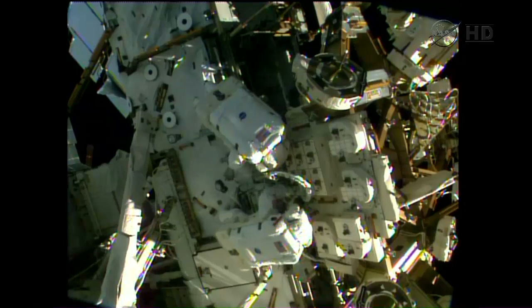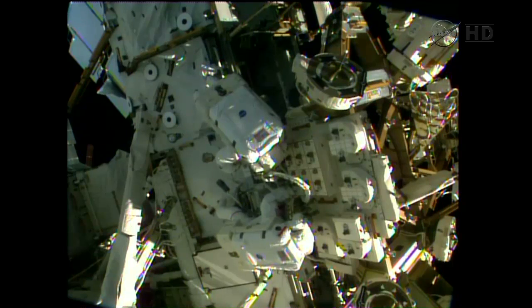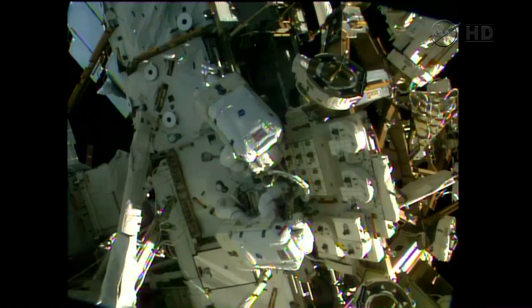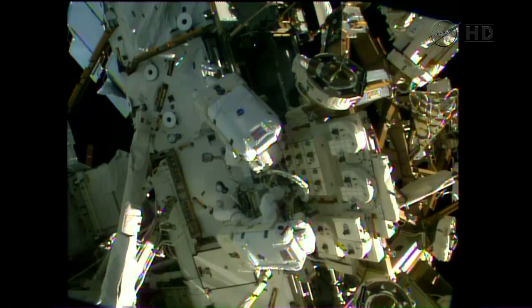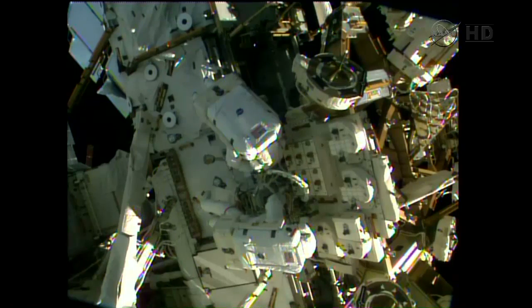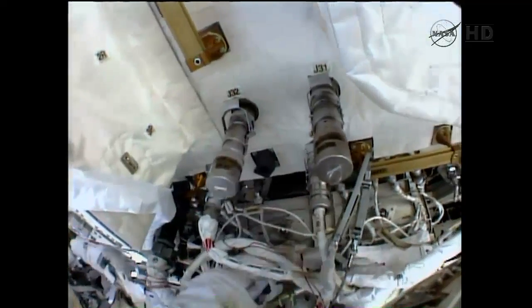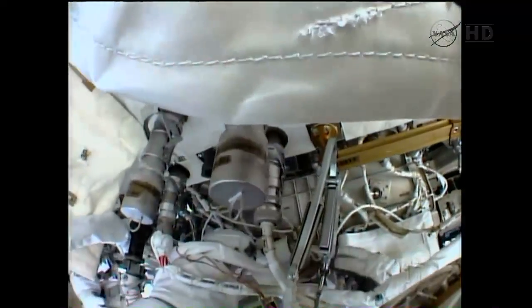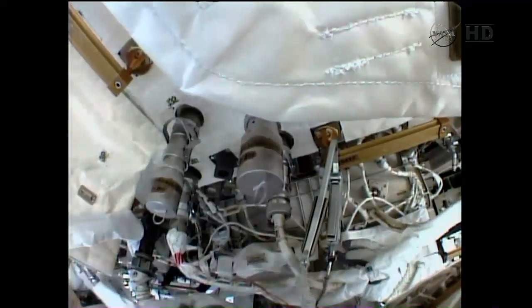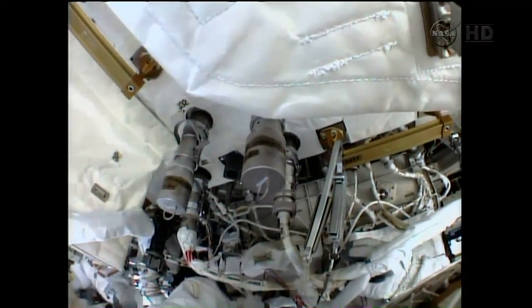We are ready. Okay, so you've prepped the blue cable. I think the caps removed, and then the wire tie through the booty tether points again. Okay, we will get that in work. That is not complete yet. Okay, go ahead and work on those: remove the blue caps, feed the wire tie through the booty tether points, twist the wire tie 3 times, and remove the booty using the wire tie tail on the caps. Sounds good.